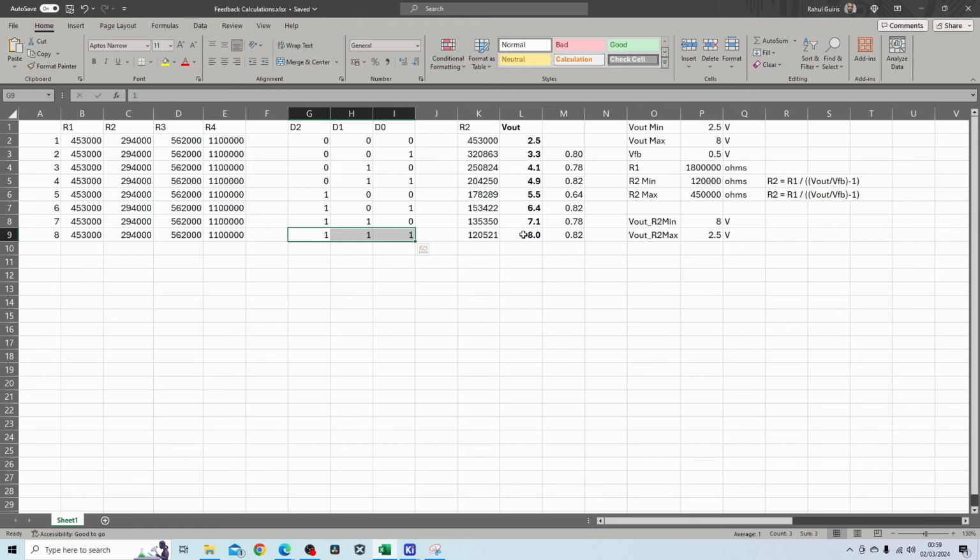So hopefully this will make the circuit a little bit more interesting. I'm not 100% sure how it's going to work, but we'll test it and we'll see. As I said, we'll add a bypass for this just in case. The main thing I need from this board is 3v3 plus 5 and 12 volts. So as long as we have that, this is just an additional bit as a bit of a fun exercise to see if it will work.